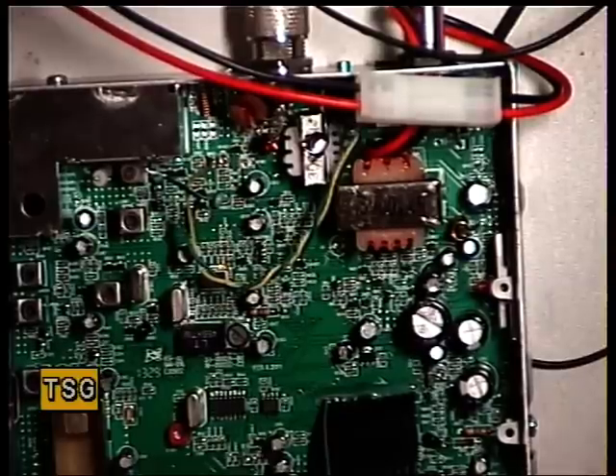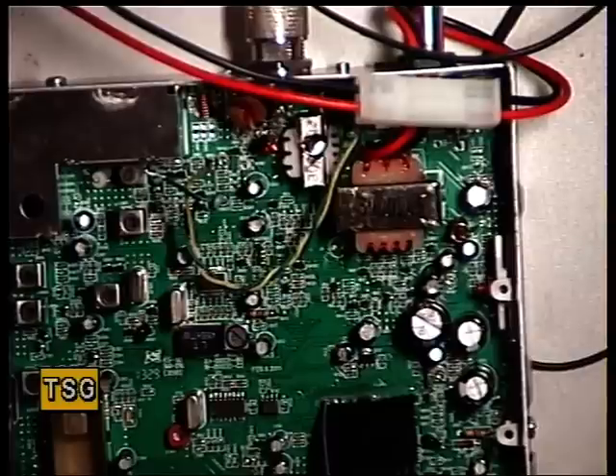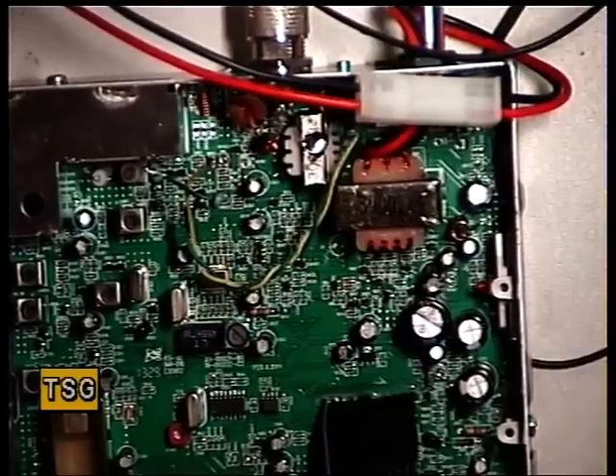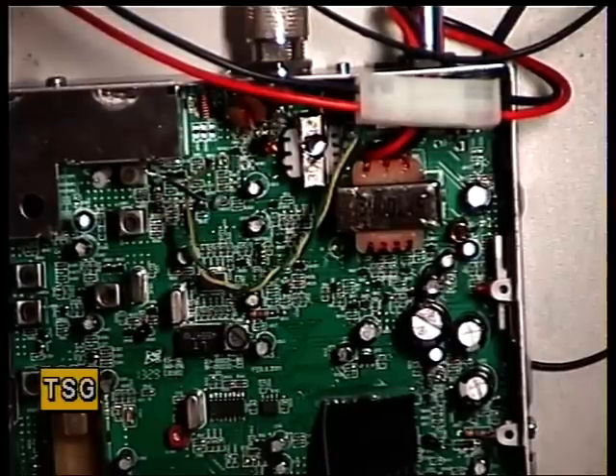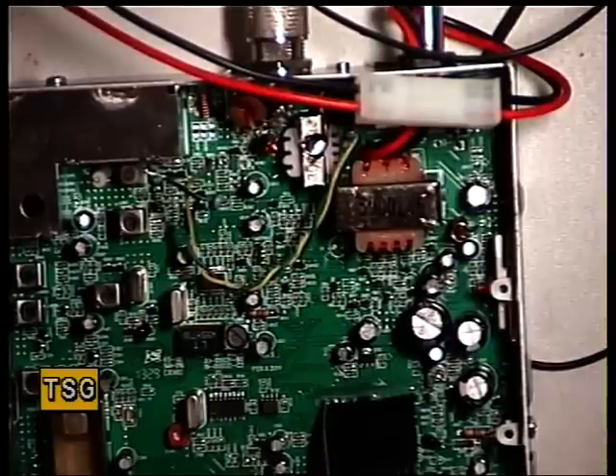It comes straight back in — that's very sensitive. I'll turn the squelch to full and see when the signal generator comes in. And it comes in at 300 microvolts, and that's absolutely fine, that's just what we'd expect.